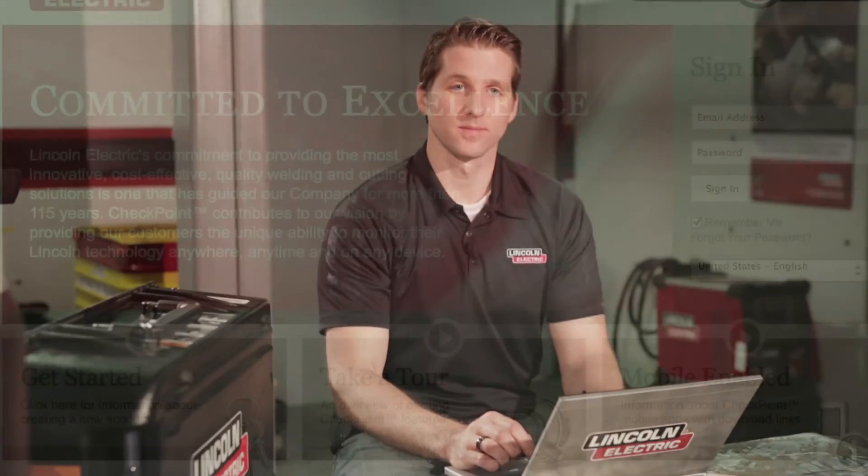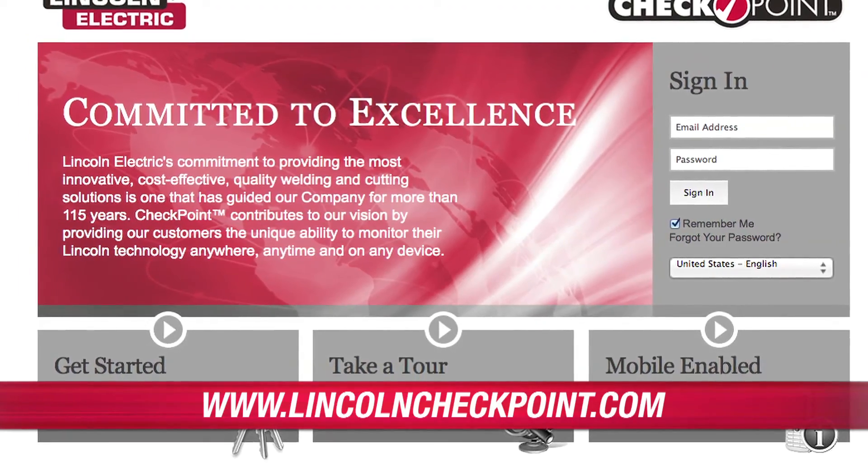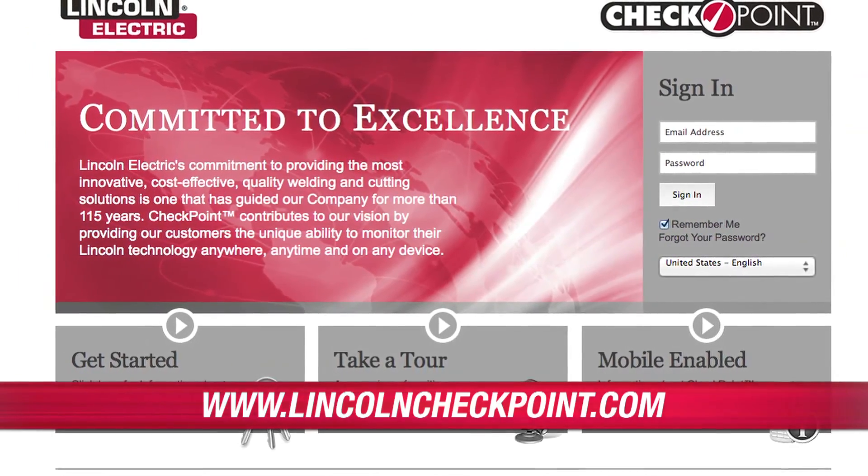This is a great tool that allows me to make changes to any machine connected to the Ethernet from my desk, without having to walk out to each system and make those setting adjustments. PowerWave Manager is also the tool you would utilize to set up your Checkpoint account. Through this tool you would get the installation key file necessary to register machines to your account. So this tool is a flexible tool that helps you diagnose problems with the machine, customize machine settings, and customize your Checkpoint account.